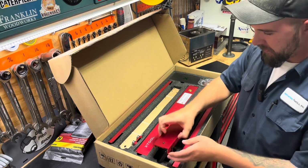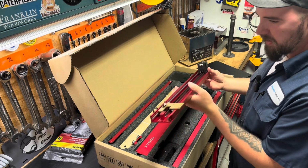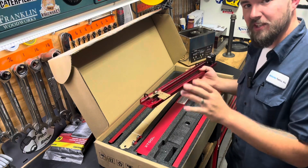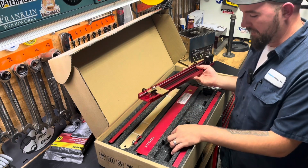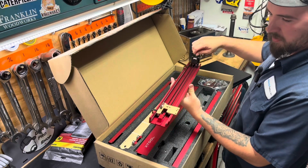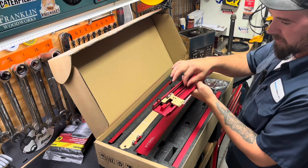Man, all anodized aluminum. Looks like this is extruded aluminum, not billet. Well, like I said before, this is affordable. If we were to get this thing billet, yeah, Bill Gates might even be having an issue getting this thing. Oh, look, we got a servo motor driving a belt here. Looks like there's an encoder. This is a nice cog timing belt.